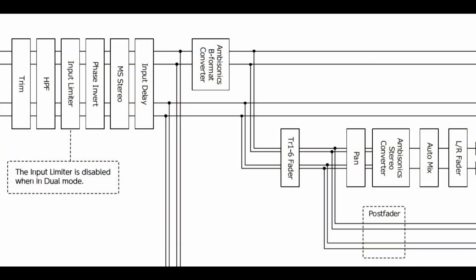Here we see the setup for linear recording in either 16-bit or 24-bit. The first thing to notice is that the input trim — the input gain — on the far top left is not connected to the fader controls at all. The fader controls are after that whole block of input processing and actually only affect the mixed feed — the left and right mix — and not in any way the signal going to the record tracks. So if an input is over-deviating at one of your track inputs and you reach out and turn the gain down, all you're doing is affecting the contribution from that channel to the mixed output, not the level you're actually trying to adjust in the track recording. That's the bad news.